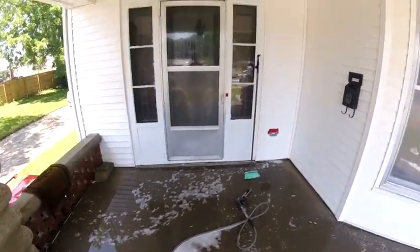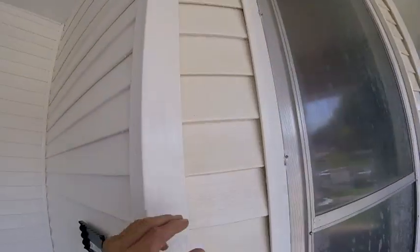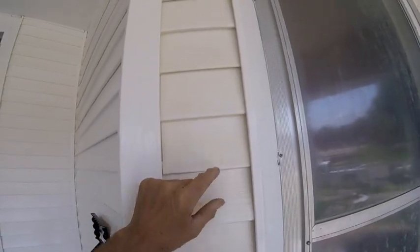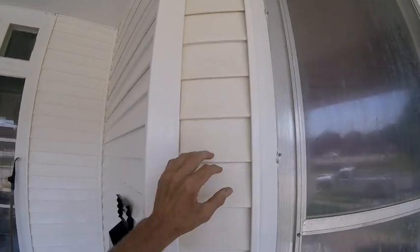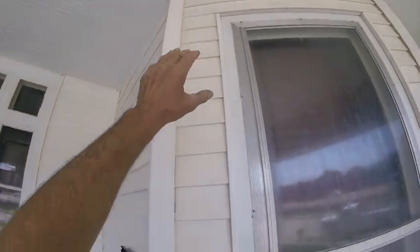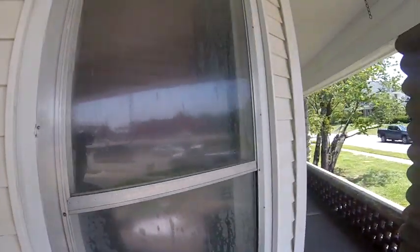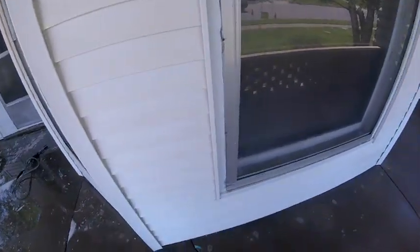All right, guys, so I'm here taking down the fallout. You can see where I've taken the fallout off here, and you can see this is what a lot of posts are on the forums. Is I washed the house and it's still dirty. I still have yellow and brown on it, and sometimes up toward the top it even feels a little sticky. But anyway, this will not come off with SH, sodium hypochlorite. See how yellow it is? Yellow. I've already washed this porch down, soft washed it.